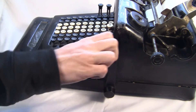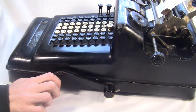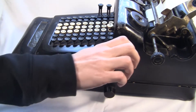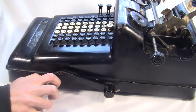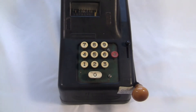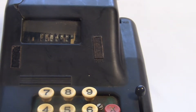On a big old machine from the early 1900s, you had to really pull on that crank pretty hard. When you need to use some force, it's easier to pull a crank that's sticking up rather than push a crank that's sticking right towards you — it's just the geometry when you grab it. Up here, your pull is perpendicular to the crank arm, so you get maximum torque with minimum force. It would be an awkward motion to try to push this crank up, especially with a lot of force. On the Barrett, the upstroke doesn't do anything inside the machine — the business really happens when you pull the crank down, and you can feel it. You have to pull down a lot harder than you push up, and this is exactly what you want, since your arm is better positioned to apply force when going down rather than up.